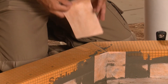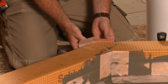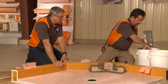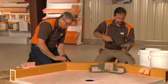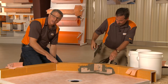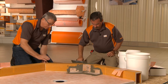So we've got that piece on. This piece is going to go in the back — I've just sliced down about two inches — and I'll install that on the back side of this curb. So we folded that lengthwise just like we did these pieces, and then we cut right to the corner so we get a bit of an overlap so it'll lay flat. Now you're going to have buildup out here. We have these two pieces and then we're going to do one more piece over the top to treat the top of the seam. The buildup is higher on the outside than the inside, but that shouldn't be a problem because we want this tile on top to kick in towards the shower just a little bit. The tile shouldn't be flat on the top of the curb — it should have a bit of a slope so if any water hits it, it runs back into the shower instead of out.